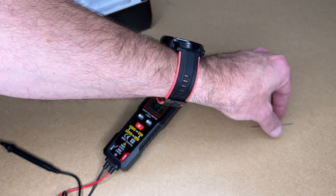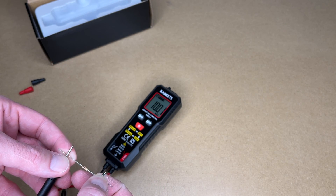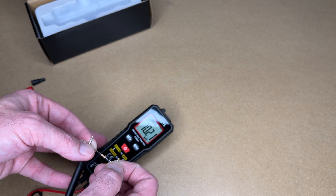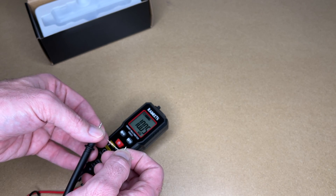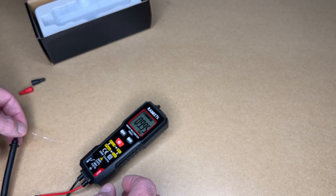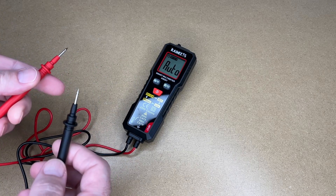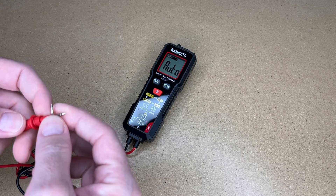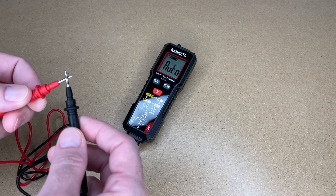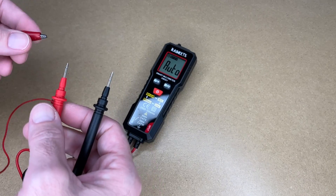This will do resistance also. I have a resistor here — this is a 10k resistor. That's just spot on, or pretty close: it's reading 10.04k. Now there's a tolerance in these resistors. I'll hit that hold — it's shifted a little bit but here you can see it says 9.95k. We can also use this to check continuity. If I just hold the probes together it will beep. Now these aren't super fast, so if fast continuity is a feature you need in your meter this is probably not the best option, but it's there if you do need it.